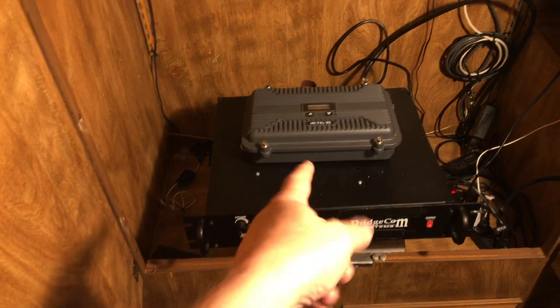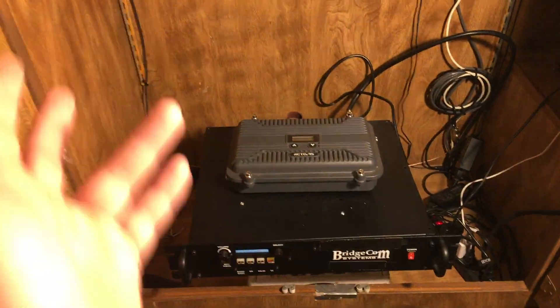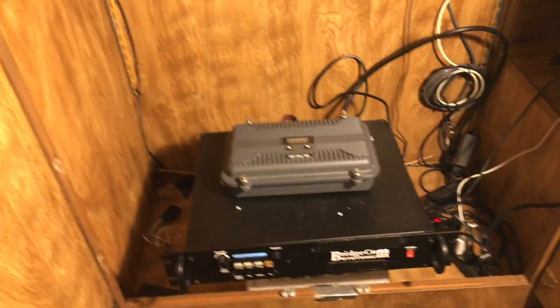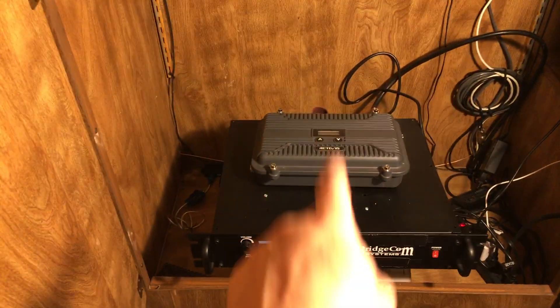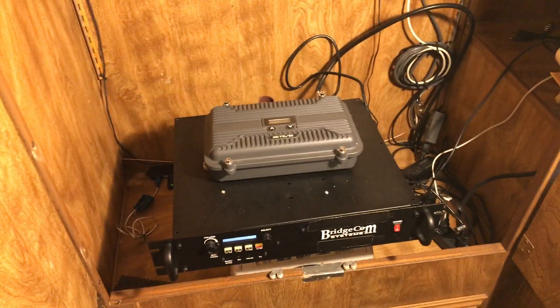You're probably wondering why I don't just match them — well, then I'd have to retune my repeater with the duplexer. Either one would have to be retuned, and for that small difference I don't think it's worth it. Both will be at six watts output and squelch level five.